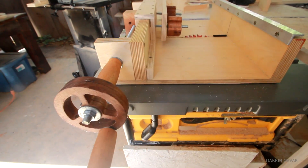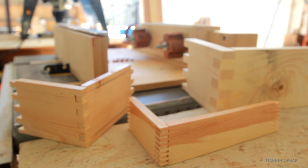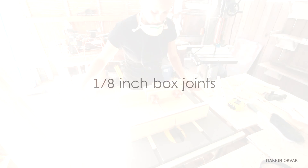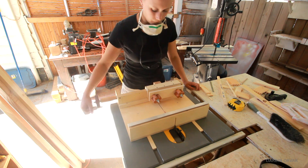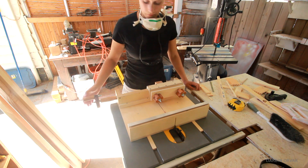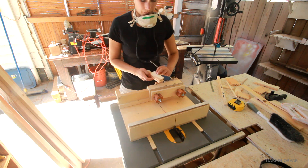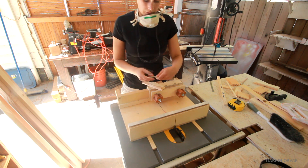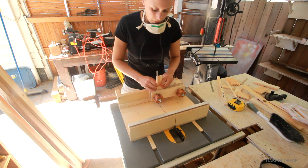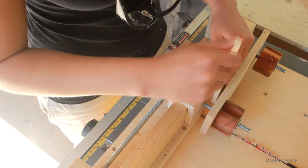What's really awesome about this jig is the fact that you can create any size box joint you want — you just have to adjust how you use it. Let's start with the simplest joint, which is 1/8 inch. First of all, make sure the carriage is positioned to the left. Also, make sure the handle is positioned up — this will be your reference point when you spin later. If you want to cut two pieces of wood that fit flush into each other, then you need to space them out evenly. I've found that it's a lot easier to create a spacer for each sized joint. For the 1/8 inch joint, I have a spacer that measures 3/32nds, because that's the thickness of the blade.